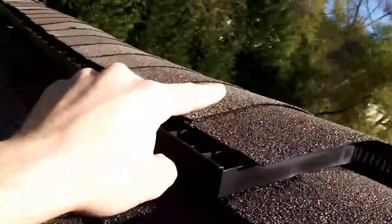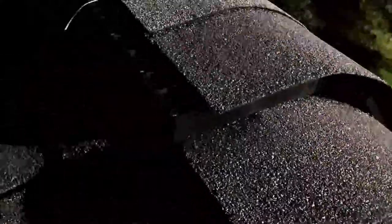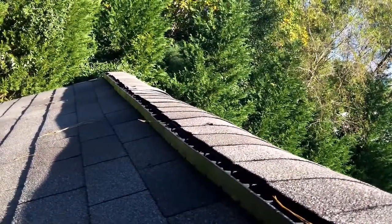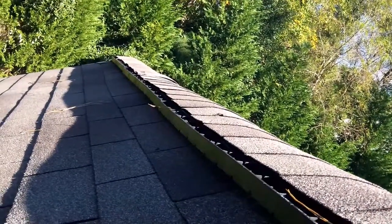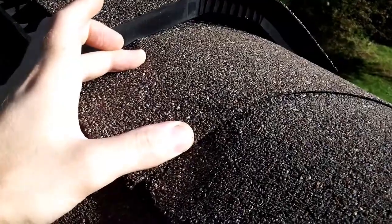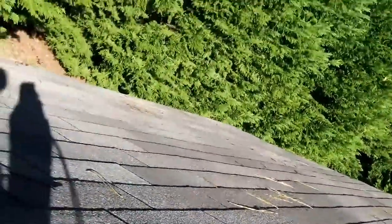Make sure on the inside of your roof there's a gap for the vent. The idea is that all the hot air from your structure rises up to the ridge — the highest point — and goes through that ridge vent and out through those holes. You shingle over the ridge vent and nail through it. My friend who knows about roofing was helping, and we needed a rope up there for safety. You double back: put one cap shingle, then the black material shows, so you put the colored material from your shingles back on top, nail it in, add some roofing tar, and you're done. You get a nice ridge vent and all your shingles — unfortunately there are already pine needles on it, but it's a shed, it'll deal.